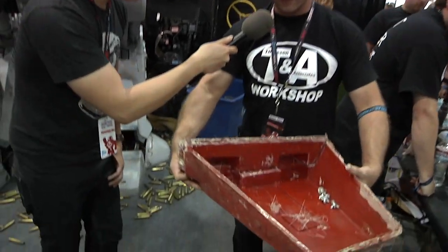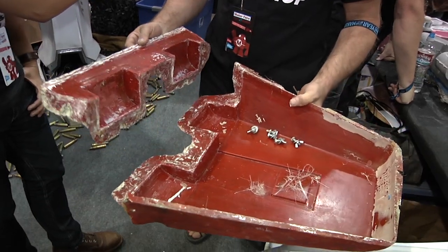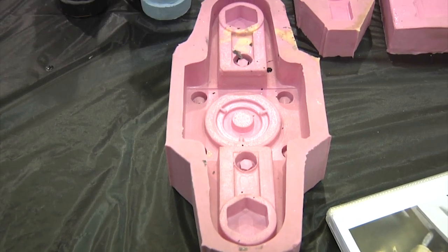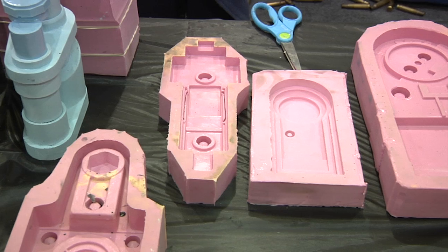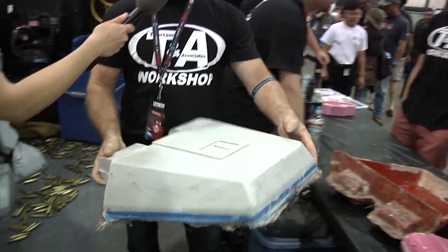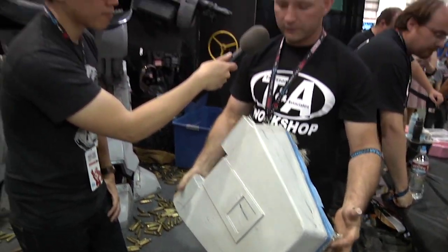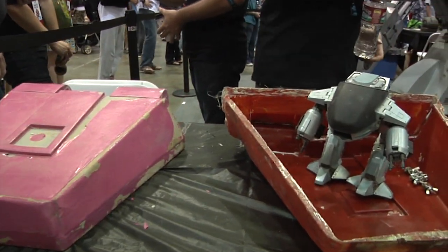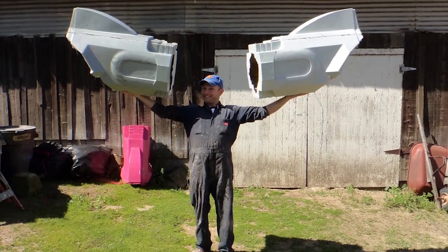You can actually see one of my molds here — it's a little on the rough side. It's a very rushed build, so we didn't have time to really polish up most of the actual molds. But once the molds were made, it's just a question of getting them polished up on the inside and then laying up another fiberglass part on the inside. You pop that off and you've got what you see here. By comparison, it's built exactly the same way as you'd build a sailboat. It's fairly sturdy, very lightweight. The gel coat on the outside is UV stabilized — you don't have to worry about it rotting in the weather. This thing will outlast me by a long time.